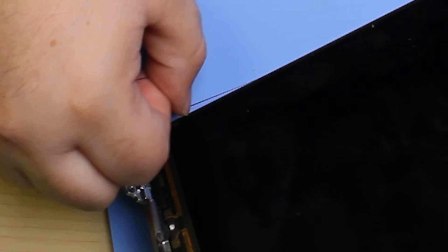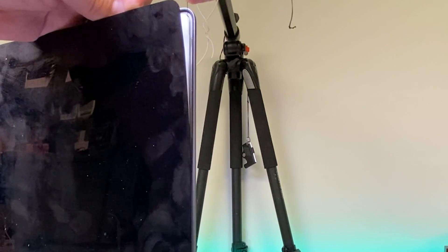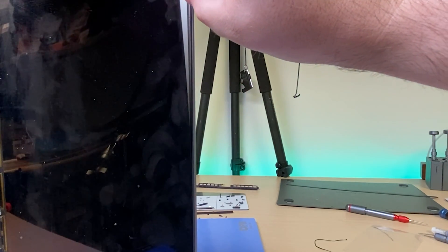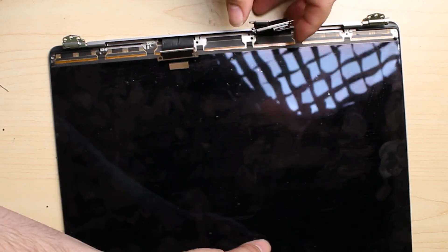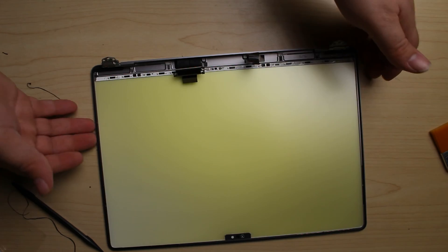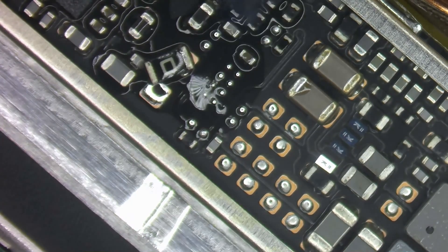Continue to find any broken pieces, but if you go nice and slow enough you'll be able to do this. You can use a little bit of heat as well, just don't go crazy because we don't want to mess with the backlight. Nice and slow — here's the trick with this adhesive — and it'll pull out giving you a clean panel removal. If you take your time and go really nice and slowly, the panel will slide out, leaving the backlight intact and behind. We'll set this aside so that it doesn't get any dust or debris on it.